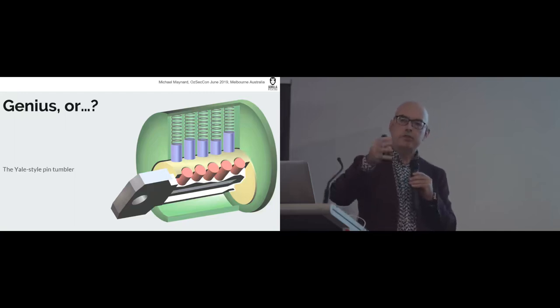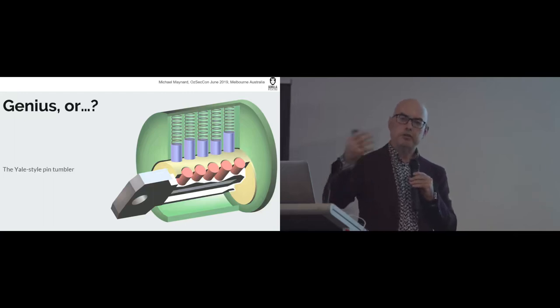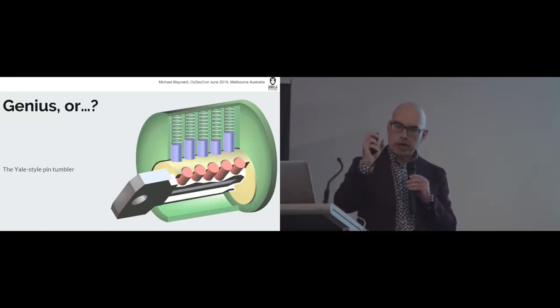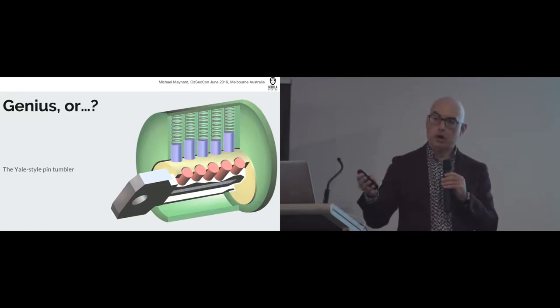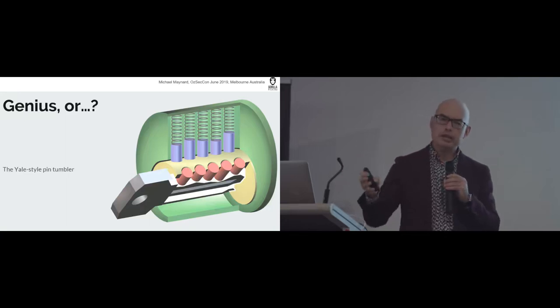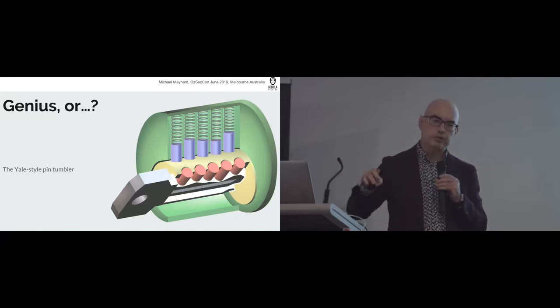And then in that very same movement, we are now accomplishing the third step, which is moving the locking element, right? So all those three stages happen in a very, very compact time frame. Now, that is the great genius of the Yale lock, right? But it's also really its major weakness. So the reason that these things are so easy to open is that there are all sorts of things we can do to exploit this thing.